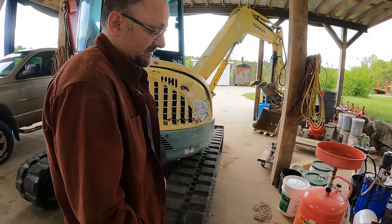The only thing my manual says about this adjustment is to not change it, and that it affects the displacement of the pump and therefore the horsepower. It doesn't say anything about adjusting it or how to determine if the adjustment is correct. So until I know more, I really don't want to fool with it and end up damaging something. This one about whipped me. It's better than it was. I can certainly tolerate it like it is.